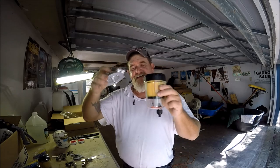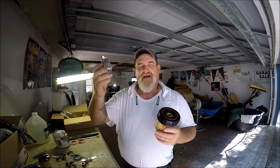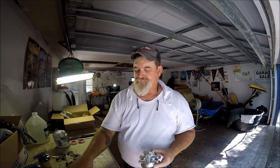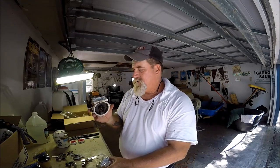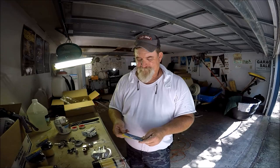It costs you twice as much. This ends up at like 60 bucks or something. The small hole - so when you have a Raycor, unless you've got the small hole head unit, you can't use this MARPAC filter. You must buy the new head unit, which I did. That's problem number one. You've got to decipher this stuff because MARPAC isn't telling you anything. MARPAC, if you're listening, you might want to say something.